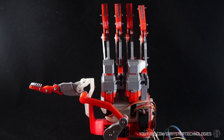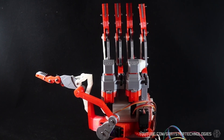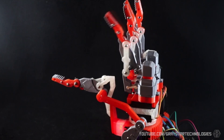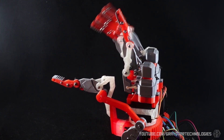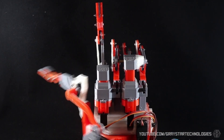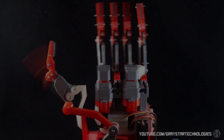Once I decided to take a break from that project, I went back to designing more humanoid hands. This is the first hand I designed that uses servo motors converted into linear actuators to create the movement. The idea was to have a robotic hand where all the mechanisms are housed inside the palm itself — unlike an InMoov robot where all the servos are in the forearm. This way it could also be used as either an open-source prosthetic or for lightweight robotics projects. In my project, I wanted the hand to be easily swapped out and replaced with a different style of gripper.